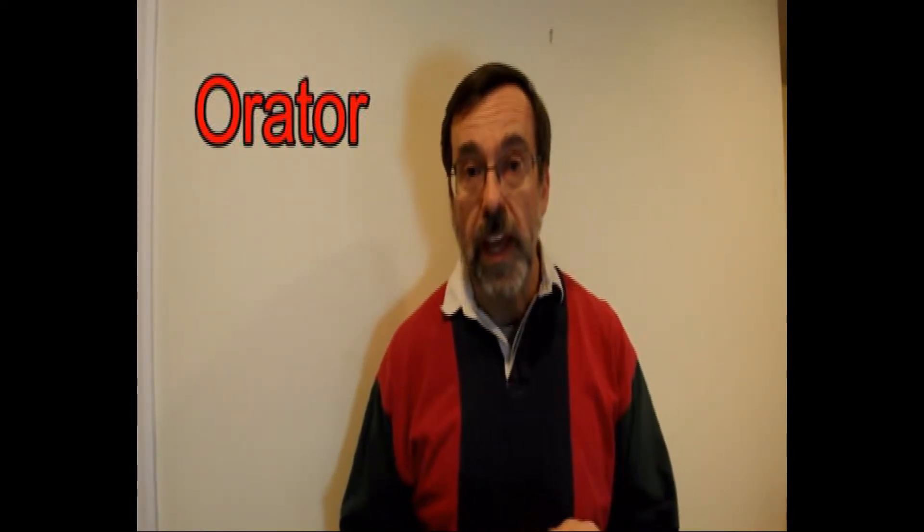There is however work for you to do. It deals completely with the volume and also the EQ. Every person's voice is different, so the purpose of the equalizer is to allow you to adjust the tone in their voice so that it is as clear as possible. Typically for men's voices, you want to take out some of the bass and maybe add some mid-range because their voices tend to be low and rumbly. Women's voices are often a little high and squeaky, so sometimes you want to take a little bit of that edge off by removing some of the highs and adding mid-range.